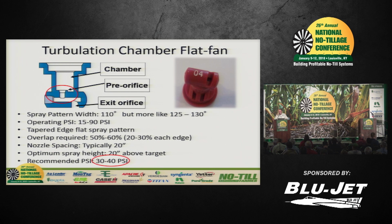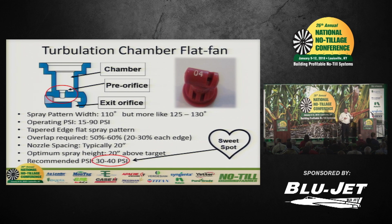In fact, when this nozzle was first introduced, it was a very good nozzle for our modern day spray equipment, which was self-propelled, higher speed, longer boom systems. Because it had one of the most uniform spray patterns in the marketplace at that time, and it had the ability, when that boom started waving around a little bit, to keep that pattern uniform. Same kind of overlap. Sweet spot, 30 to 40. Now, this nozzle is the one I have to recommend to you for any coverage products that you're thinking about. This replaces the XR. Okay?